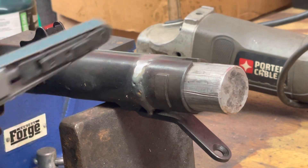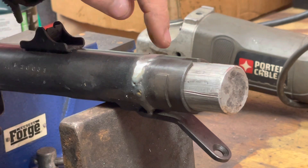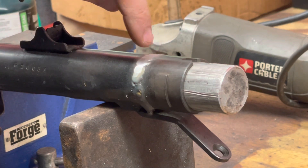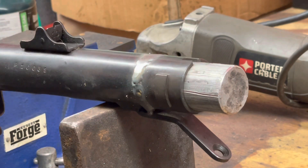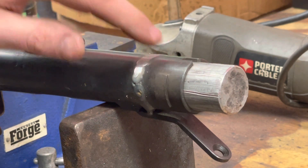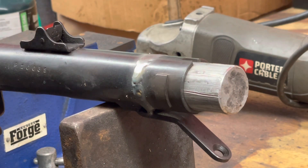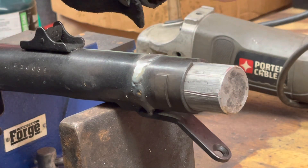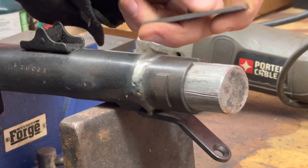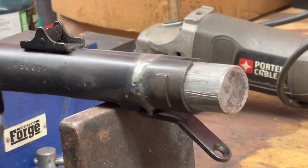I'm starting to feather the existing receiver. I'm not really touching the receiver yet, so I'm not taking any of that metal off — that's exactly what I want. I just want to take the weld off. Anything I touch on the sides here is just collateral damage. You're going to feel a little ripple. After we're done, I'll check with a straight edge to make sure everything's still flat.